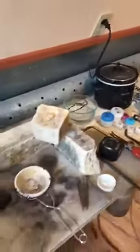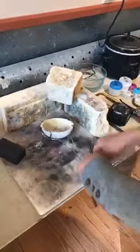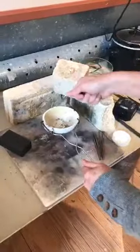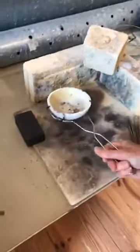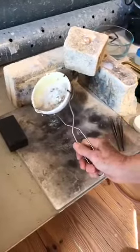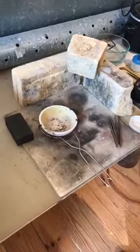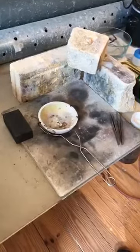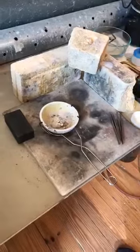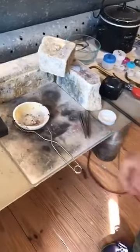A couple of things you saw when I was doing this: you have to keep your flame on the molten silver as you're bringing it over to the mold, and then keep it on there as you're pouring it. You want to do it all in one go — if it stops pouring and then you pour again, it will break up and you'll have two ingots, or it just won't be a good pour.